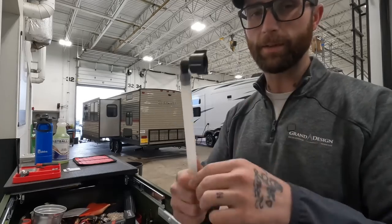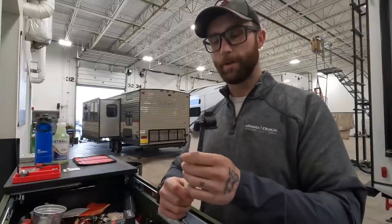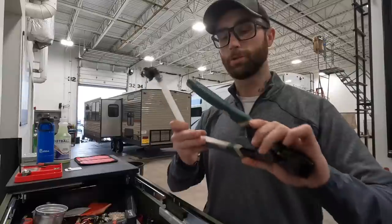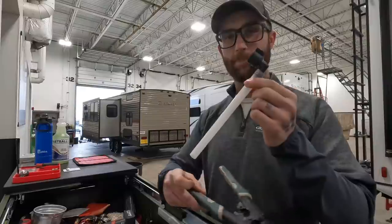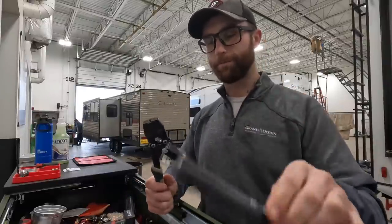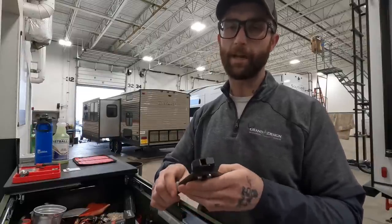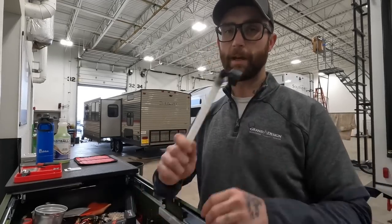PEX is a little bit flexible, so it's easier to work with than copper. You're not sweating copper or making cuts with special tools. You can see how fast it goes — it's super easy. Having these tools on board can save you a bunch of money and time when you have leaky fittings or a pipe chewed through by a mouse. You can pick up PEX crimpers and cutters for less than 50 bucks. Amazon even has kits that come with crimps, fittings, 90-degree elbows, and more.